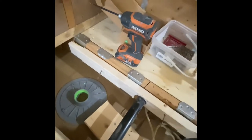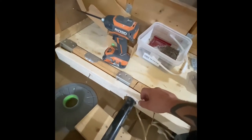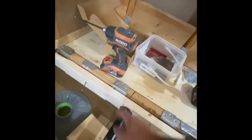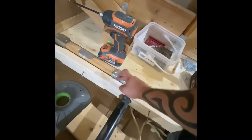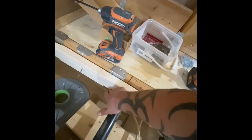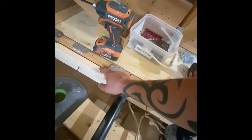What we've got going on right now is I'm recessing the floor with the brackets that come with the hydro block curbless shower kit. Essentially what it does is it hangs on your joist like this, goes down, and your 2x4 sits in the saddle down here, leaving you three-quarters recessed right here for your shower.